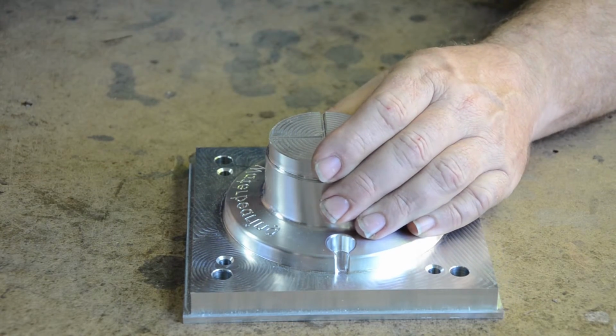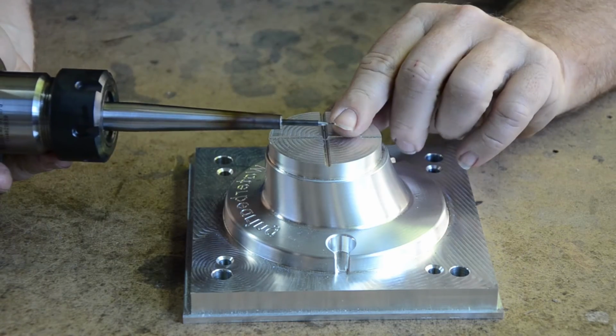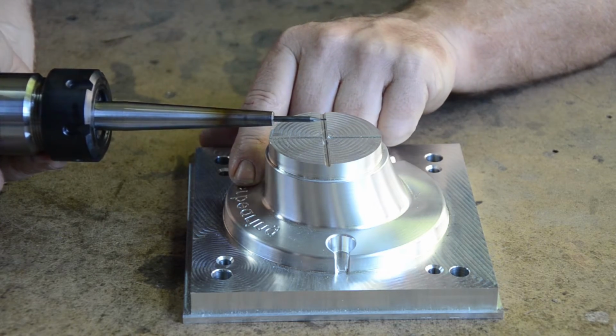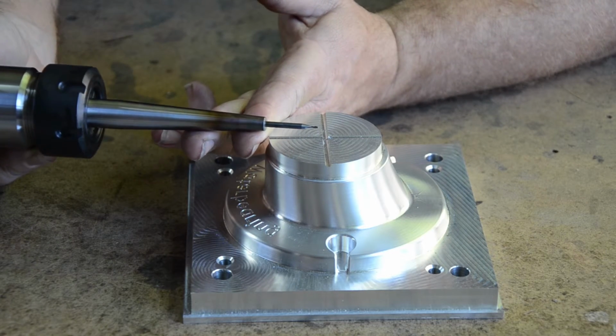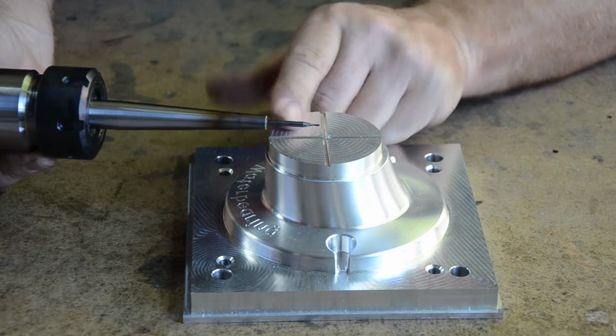And the lettering is an interesting idea because I used a very, very small end mill for that. I used a 3/64 end mill. Think about that, spinning at 9,000 RPM to get these letters. So, wow, 3/64. Think about what it takes to make that. That's crazy.